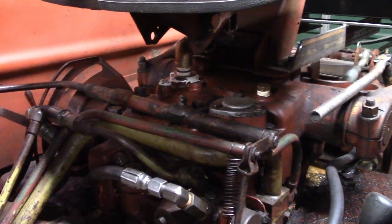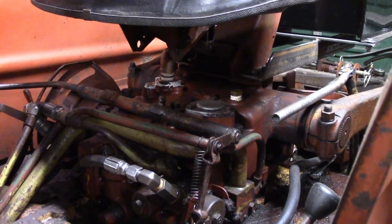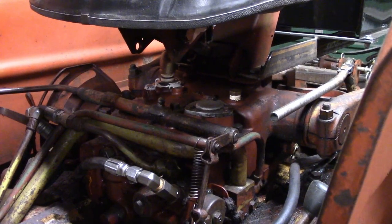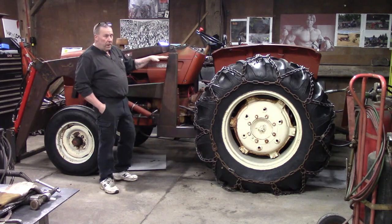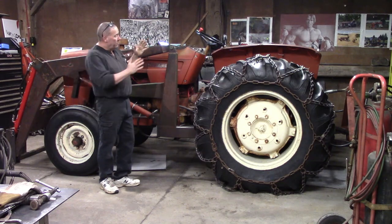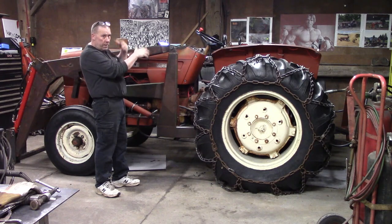See how that comes up over — it's that larger green one — and down and over. So if you follow that line, that reservoir is just barely higher than the suction side of the pump. You can see where that may cause a problem: if you don't keep that hydraulic pump flooded constantly with fluid, it's not going to pump.